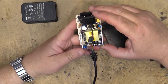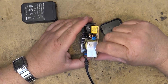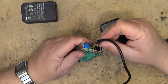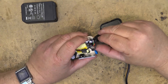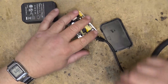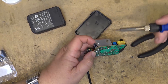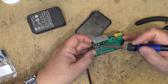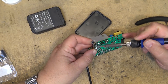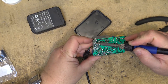I get a feeling it's probably just these two caps — 1000 microfarad at 10 volt. It's likely just those two that have gone bad. It's got that crappy circuit glue in here too. I'm just going to pop these two caps — I'm not even going to check them because we know they're shot.